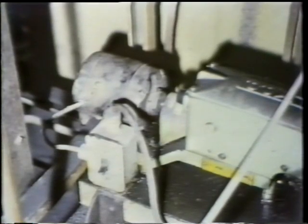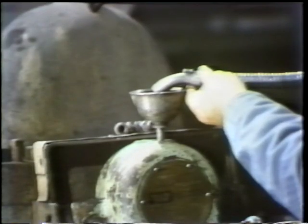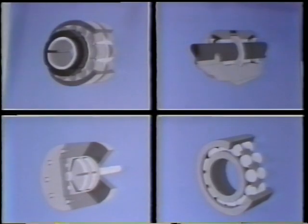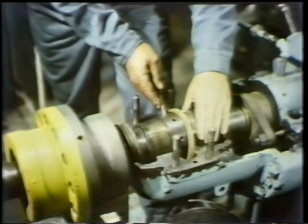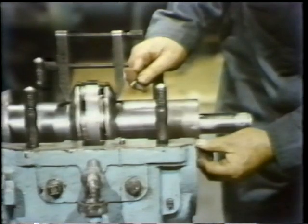Some equipment, like this motor, may use pre-lubricated sealed bearings. Others may use a grease system that has to be serviced periodically. In addition to grease, many pieces of equipment use oil lubrication systems. All the bearings we've seen in this module use some sort of oil system. The plain journal bearing used an oil system with a slinger ring. The gear reducer used an oil bath system to lubricate the bearings in the gears. The tilting pad oil film thrust bearing used a force recirculation water-cooled lubrication system.